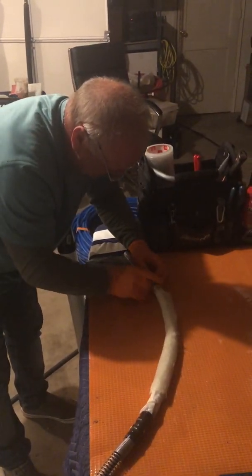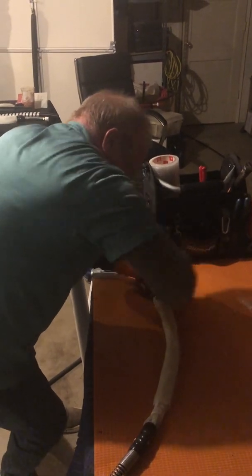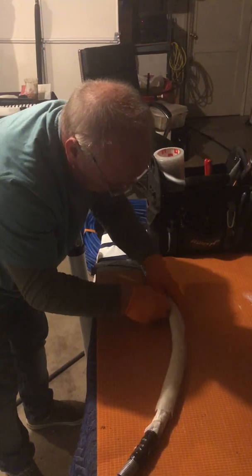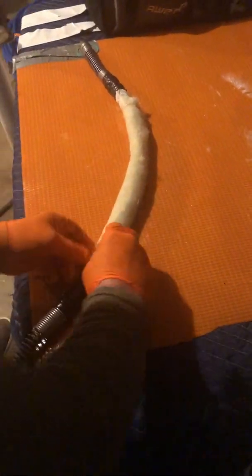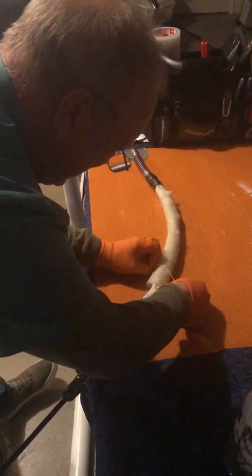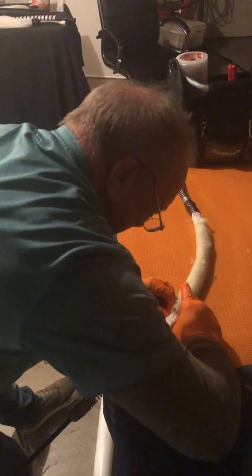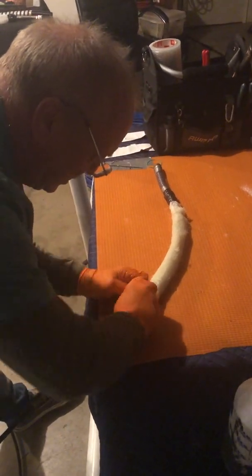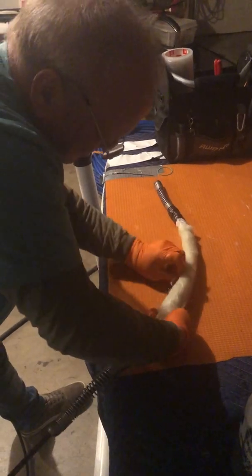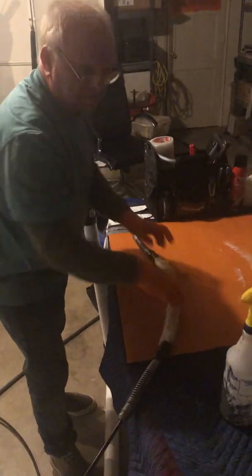We get these little elastic bands and slide the band over the edge of the packer, just nice and tight, and take the other side from the other one. As you can see on the packer, we're running this under our little air system which creates the vacuum. This keeps the packer really nice and tight, so that when you're actually getting ready to insert it in the pipe, it's as small as it can be — so you can go around the bends and around the obstacles.